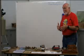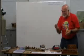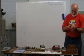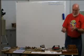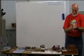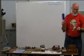One of the nice things about being a 3rd generation engraver is that you tend to inherit lovely things. I've got a lovely old engraving tool here, which has got to be over 120 years old. It's a walnut handle with a bit of old brass, and you can pull it apart and the blade comes out and fits into that little groove, and the old bit of brass just pushes over the end, and you can adjust that blade to any height you like. It's one of the most beautiful tools that I still use to this day.